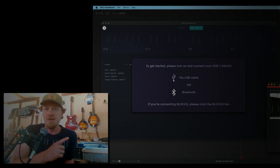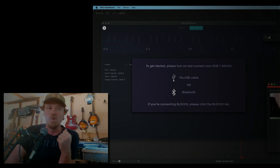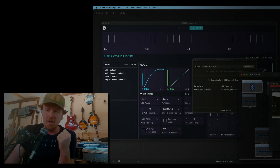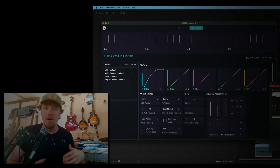I know there's other people having this problem because I saw it on Reddit, and I thought I know how to fix it. If you're having that problem, I'll show you how to fix this. This is the screen you will get if it is bricked — this is Roli Dashboard. Dashboard is their central command that shows all their devices, connections, and lets you configure them. It will say to get started please connect, cannot connect. You'll have it plugged in, restart a couple times, maybe try Bluetooth and it works, but just won't work via USB. If you're like me, you get on the Roli website, email them, and find out they're very nice people. They'll send you the USB board — about 50 bucks — which they reckoned was fried. That is not the issue, but we'll get to that.